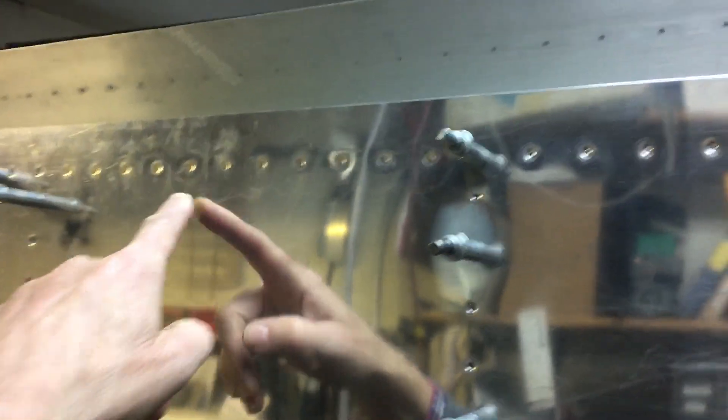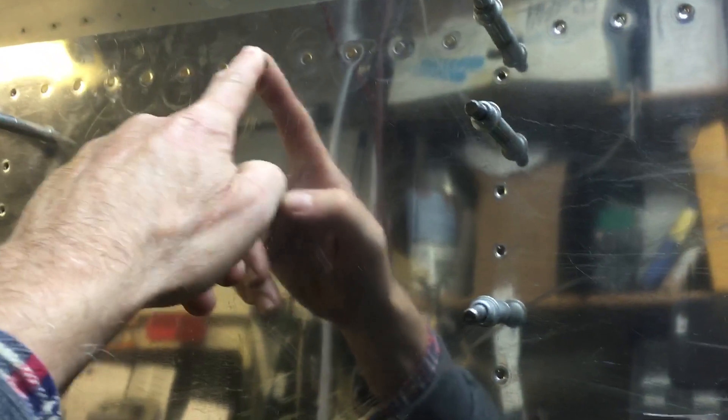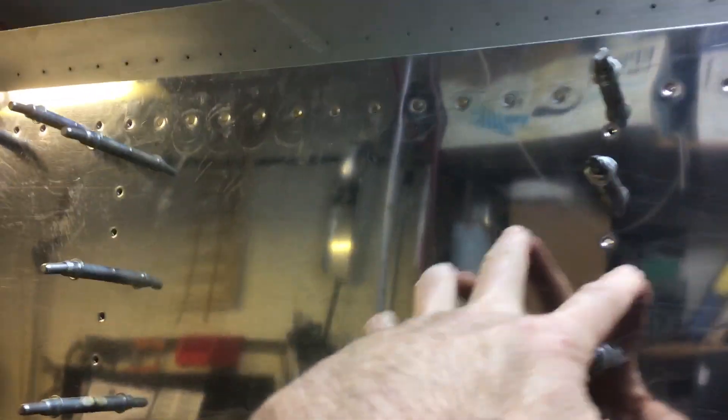If you've got the plans you know what I'm talking about, but you've got to reach up underneath of here all the way up to the rear spar and start there. Then you work your way inboard and outboard in both directions, then you start to come down to the J stringer, and then you start reaching in through the holes to do the rest of it. It's kind of a challenge, and I'm doing this by myself — it'd be much easier with a helper.